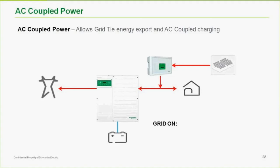There are really three kinds of grid-tie inverters in the world, in terms of AC coupling with us. There are inverters, for instance Fronius, that just don't stay synchronized. They can tell, because of their anti-islanding routine, that it's an inverter and not the grid, and they just don't stay connected. So they just don't work. The second kind, and I don't know of any good examples of this, will stay connected, but will not listen to frequency shift as a methodology for slowing down or curtailing their output based on a signal from the battery-based inverter.